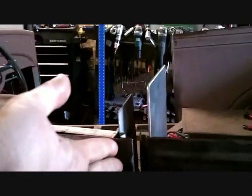I made a tab so I could clamp it to the frame and then snap it off later on. This one will connect to the floor pan — I'd like to move that over a little bit, but not too much. Things are lining up, slowly but surely. I'm going to work on that door gap — I think I'm going to end up moving the body, the back end of it, forward just a little bit. This gap's closing and it's starting to line up better.